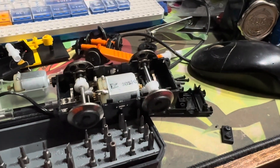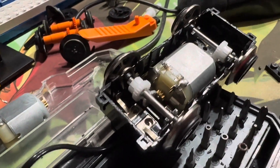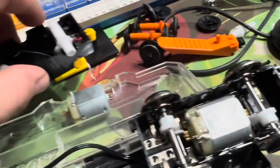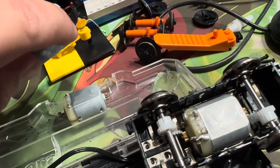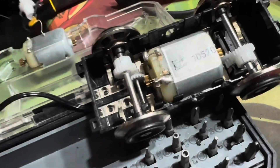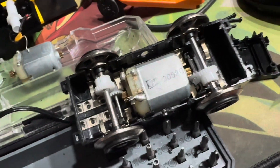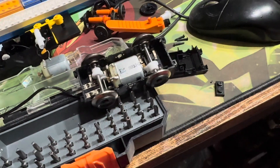We're back with the replacement motor. All we did was re-solder on those two metal plates and make contact down there. You don't have to worry about this resistor because in the 9-volt it's still there — it's just a loose part. There's a little disc; it's hard to see, but there's a little disc between there and that connector. Give it some power.